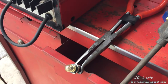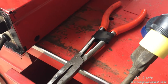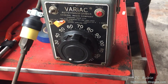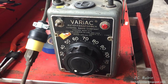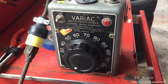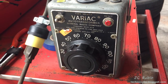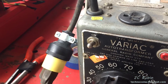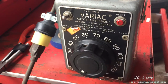This is our neon bulb holder that I'm going to use to see if it glows — not elegant, but simple. For added safety, I did bring my variac with me. For the initial voltage checking — just to make sure that voltage is flowing and take some readings — I don't always have to crank this thing up to full tilt. Just for getting in there and taking some baseline voltage readings, I can use the variac. This also gives me the ability to have a remote on, which is something I do not have on this machine without the variac in line.